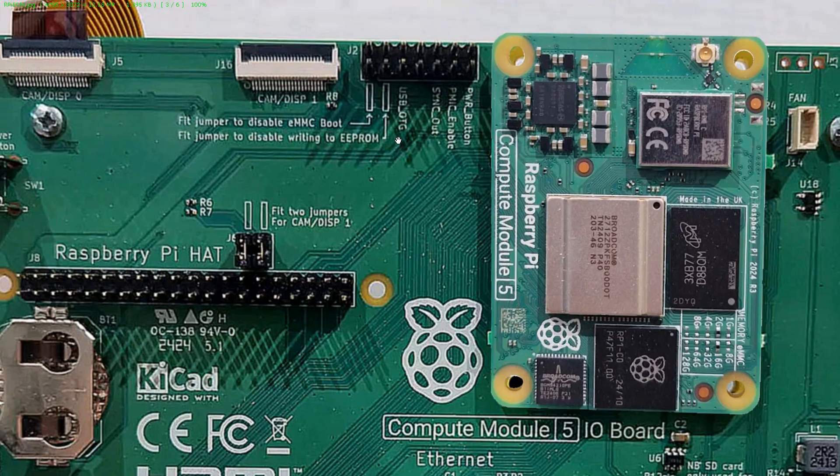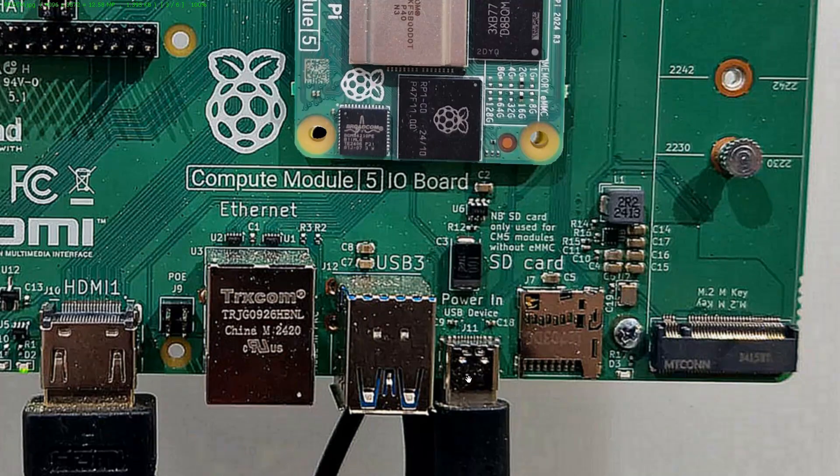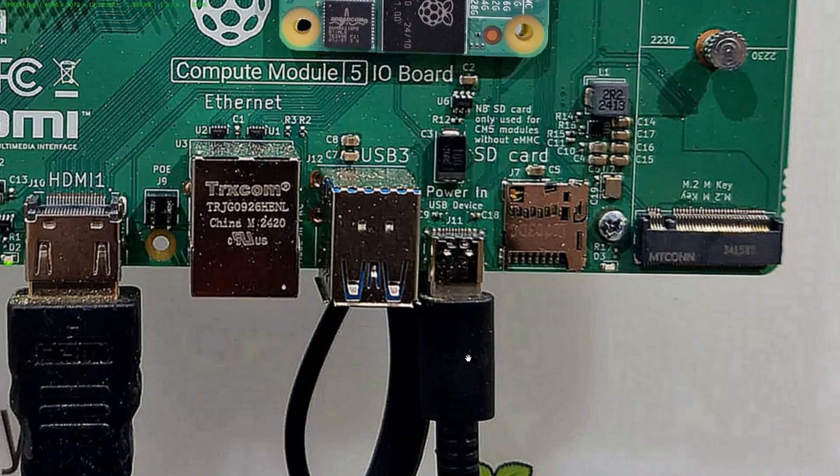Here it is — it's USB OTG. There is actually a selector and we have a USB-C port. On Raspberry Pi 5 we have to programmatically determine the function of this USB-C port — either it can act as a device or as a host. It is primarily used for powering. When it's being powered through this port, it communicates to the power supply and can tell it to raise or lower the voltage. In this case you don't want to do that, because you need 5 volts or 5.1 volts exactly to power your Raspberry Pi.